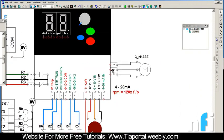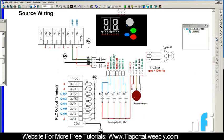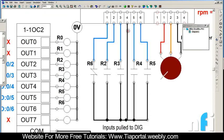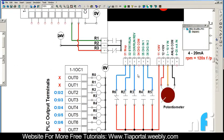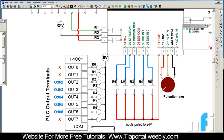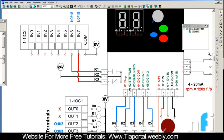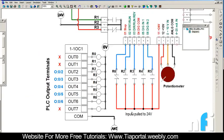The drive is connected to the motor by U, V, W pins for three phase. This is how we have wired this drive - we used a PLC to read the feedback and used the PLC outputs to activate the inputs in source wiring. For sink wiring, there is only one difference: 24 volts is not connected - the digital common is connected instead, and the 24 volts goes to the other side. It's not necessary to use a PLC here - you can use simple toggle switches, NO switches, or NC switches. But to make this course more complex and control using a PLC, which most students are looking forward to, I have done this with a PLC.